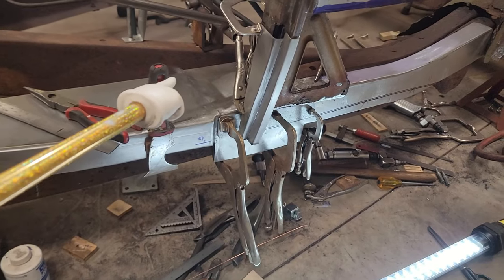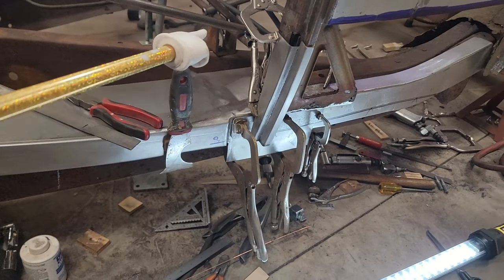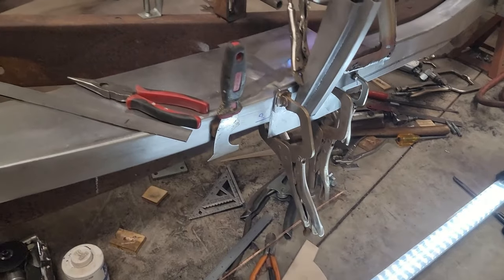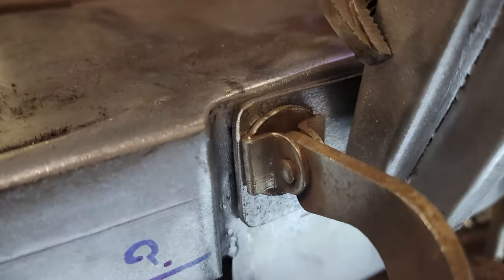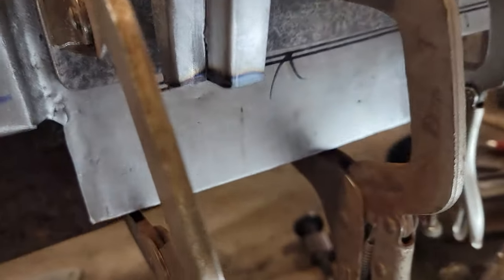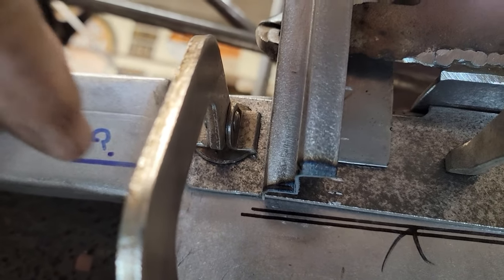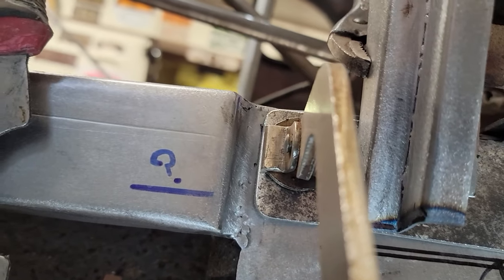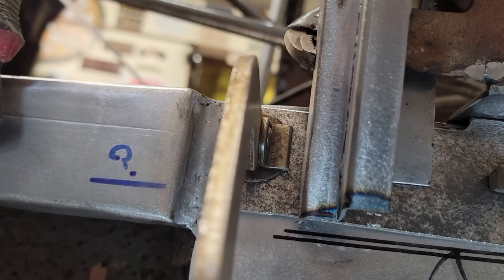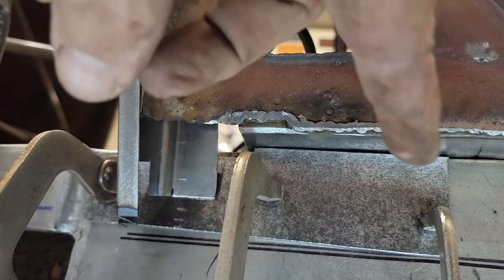I didn't know how I was going to do it, and I knew it needed to be integrated somehow within the structure of the B pillar, and this is what I ended up coming up with. It's a piece of 1/8 inch steel. It's pretty heavy as compared to what I needed. You can see it goes over to the area that I've recessed that's going to be supporting the bolt into the face of the frame. And it continues along. It's about 8 inches long.